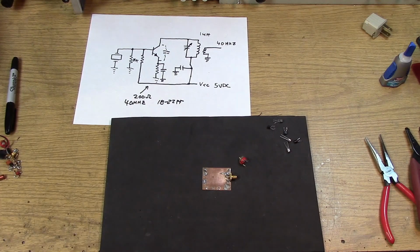Our favorite subject is, of course, winding coils for oscillators. Everybody enjoys this. This is where you go shopping for exotic mixes of ferrites and powdered iron cores, and trying to find impossible to locate adjustable slug coils, transformers and all kinds of RF chokes and coils that become the breaking point of any project. But this is a great frequency, up around 40, 50, 60 megahertz. You really don't need much inductance at all to make a good tuned circuit.